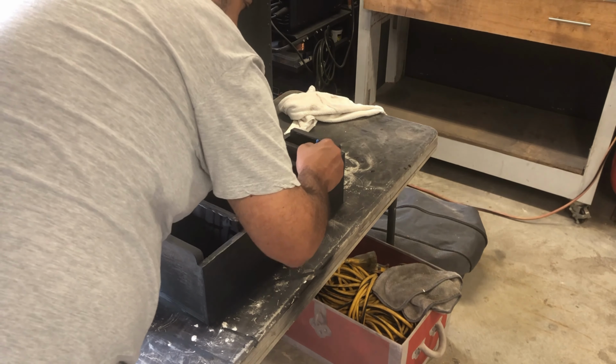So the only issue that we're having with this stand here is that there's no stud in behind here. So it's just drywall. So what we're gonna do is we've got these contraptions. What you gotta do is mark, pop the hole through the drywall. So this is like a butterfly. You pop the hole through, and then it opens up, and then you can tighten them up. And then I'll put one screw through the top, just to hold it on, and we should be okay. If I have to, I will put a screw through the cabinet into it, but I'd rather not if I don't need to, especially on the side.